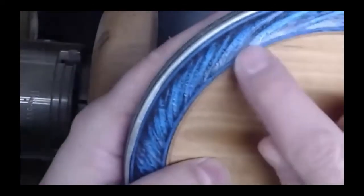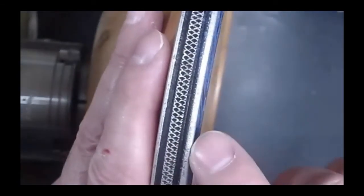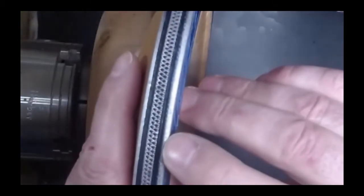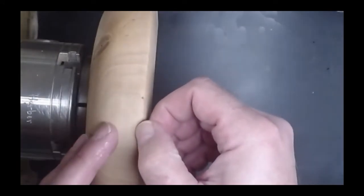One of the things you'll notice I've done on this piece is I've created a sort of a bead on the outside rim — I've separated my texture from the outside rim. If I put the knurling wheel on the very edge of my piece, I'm going to chip stuff out and I don't want that. So when I plan my piece, I plan to have a space for the texturing I apply to it. I've left enough room so I can put that little bead on the outer side and separate whatever texture I'm creating from the actual edge.